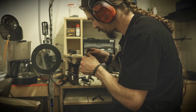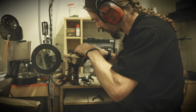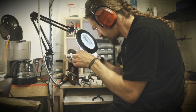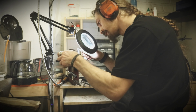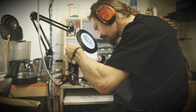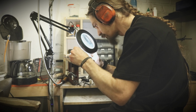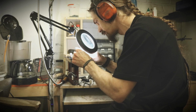That will take care of it. Then I can brush it off. It's even better if the water is warm. And doing a control here, looking that all is gone. Got a little bit left there. The flux is turning into something like glass, so it's quite brittle. If you make larger pieces, it's often possible to tap with the hammer and it will remove that way.